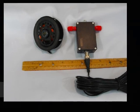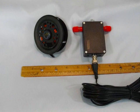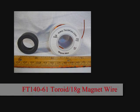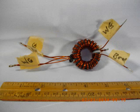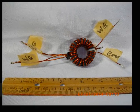Here's a photograph of the entire antenna installation. The balun only weighs 3.5 ounces, the coax weighs 4.8 ounces, and the antenna on the fishing reel only weighs 7.8 ounces, for a total of 16.1 ounces — just slightly over one pound. These parts can easily be found online; many I bought on eBay. Here's a photograph of some of the wiring details of the toroid, and it's very simple.